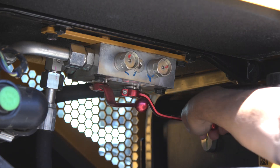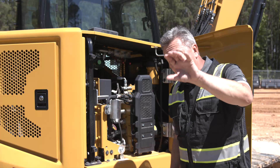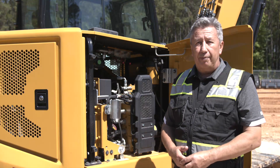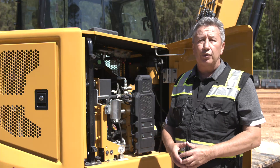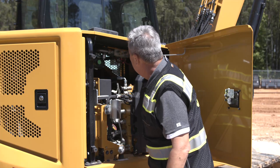If you pull the lever forward, you go into a second aux relief setting that is lower, so the bucket will overpower the thumb — which is how some people prefer to operate. And when they put a hydromechanical tool back on that requires system pressure, you simply push it back.